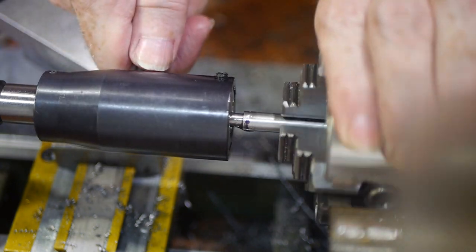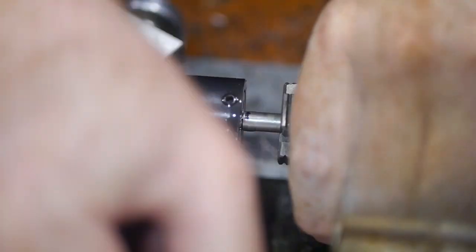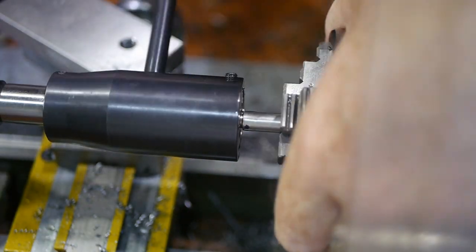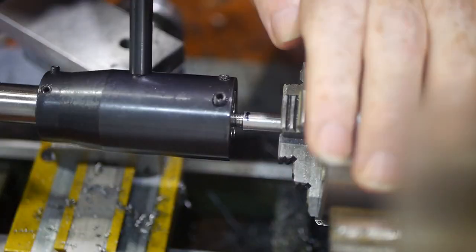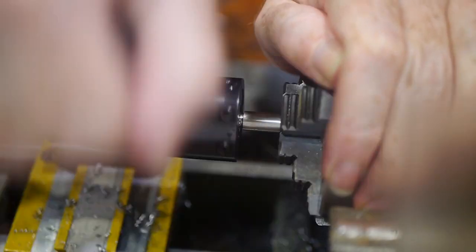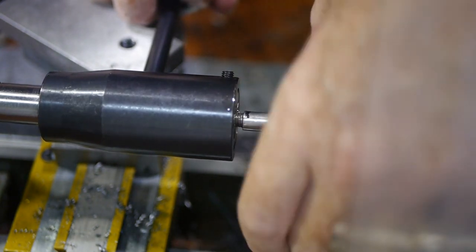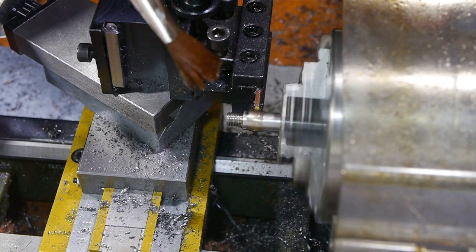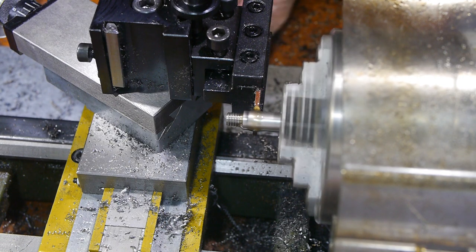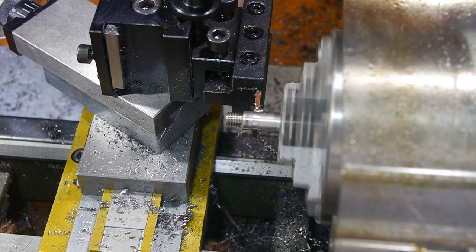Despite the mistake, the die holder fits into the tailstock well enough to use it already, so I was able to use it for its own project without having to resort to this old Tony's time-travelling trick. I flipped the die around for a second pass so I could cut the thread right up to the shoulder to make sure it fits snugly against the shaft. Don't forget to lock the tool post.